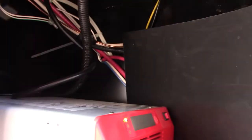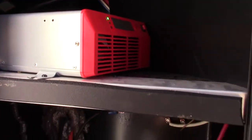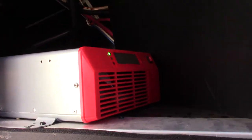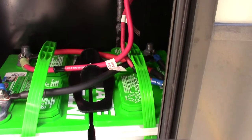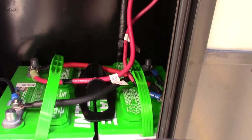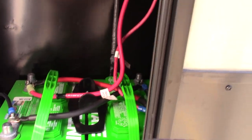You've got batteries here. You've got a power inverter here to invert power from 12-volt DC to 110 AC. You've got two batteries wired together as one big 12-volt battery, so it doubles the storage capacity — still a 12-volt DC output.